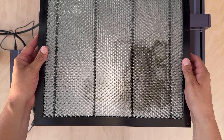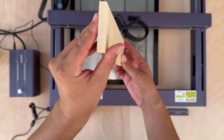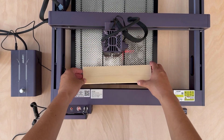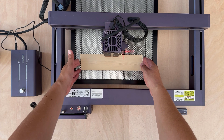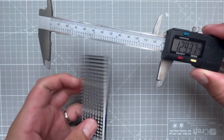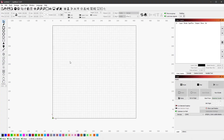I'll be using a honeycomb panel for cutting to protect my table, and I have some spare wood pieces to cut. They're quite small so I have to be very precise about placing the designs. I measured the size of the matrix display module to be 129 by 32 millimeters, so I'll start the LightBurn application.